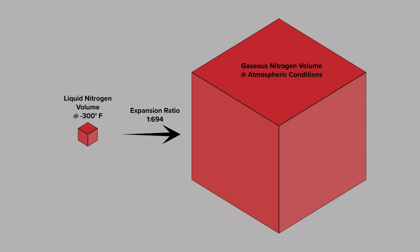So it is liquid dropped and then it expands. Liquid nitrogen is about negative 300 degrees Fahrenheit. Once it is dropped, it hits ambient temperature and it starts to gasify. One part of liquid nitrogen will actually expand up to 700 times its size in its gas form, so it displaces oxygen.